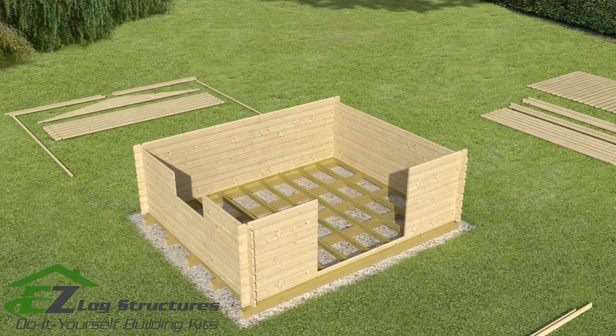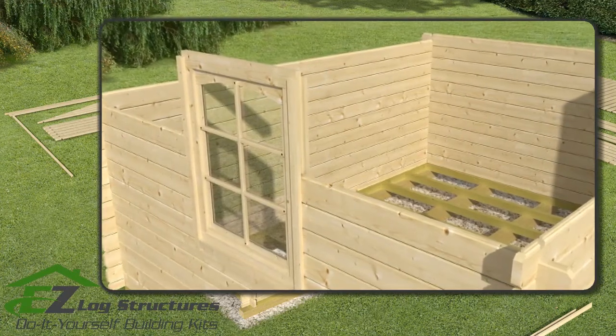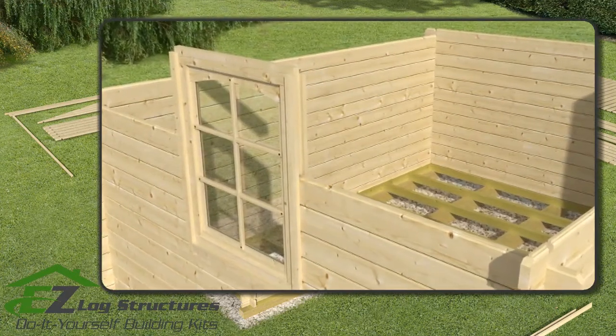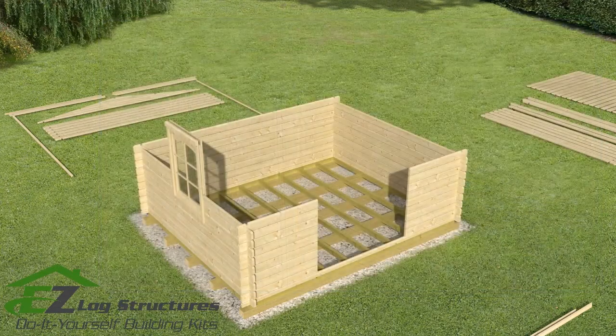The walls will be assembled quickly. The windows will be installed as you assemble the walls, and the door will be installed once the walls have been completed. Install the window when you reach the correct wall log count shown in the drawings. The windows come with the inside and outside trims already applied, creating a U-channel around the perimeter of the window.